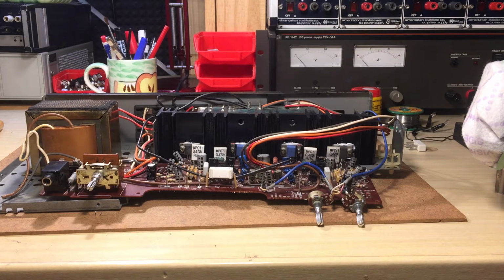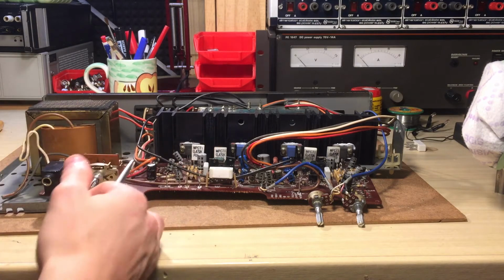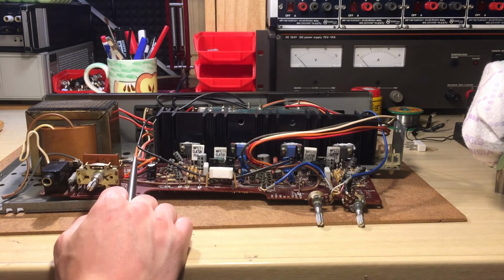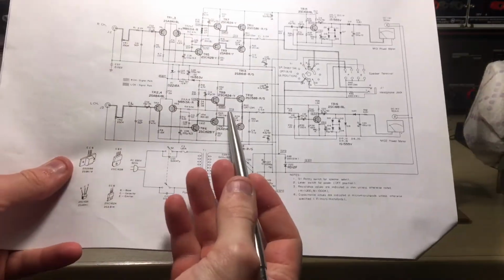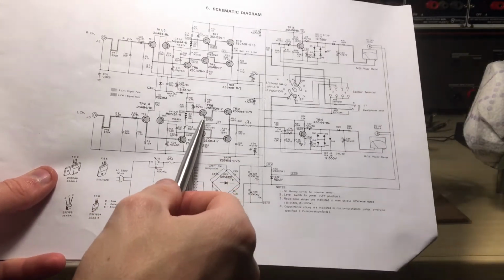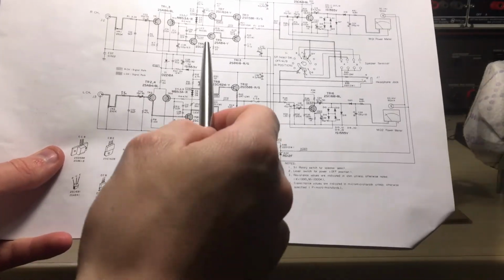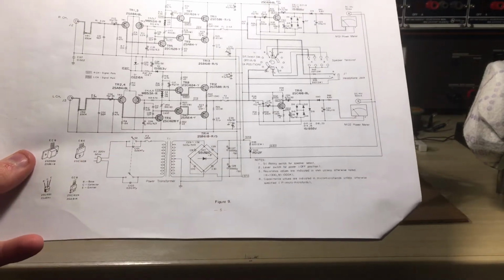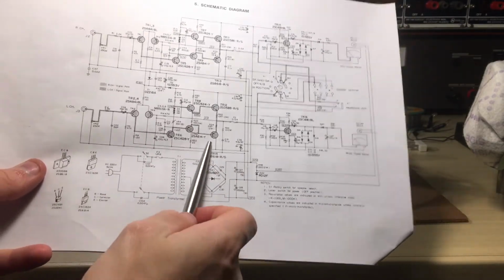Alright, so I finally managed to fix this. After hours spent looking for parts that might have been blown, or might have received too much voltage, like 0.45, and this part here 1.05. Here I was actually getting almost 40 volts between the base and the emitter of those two transistors, and here as well.